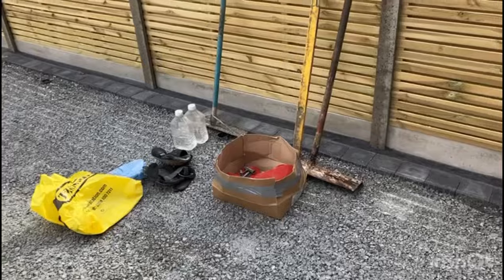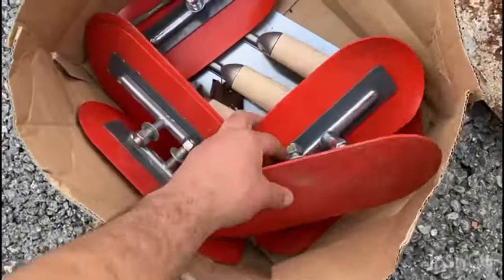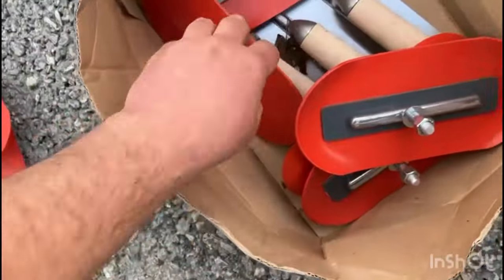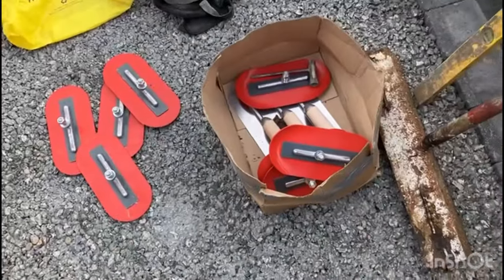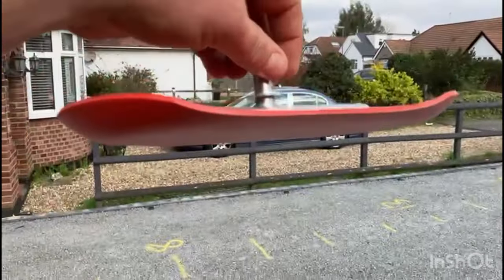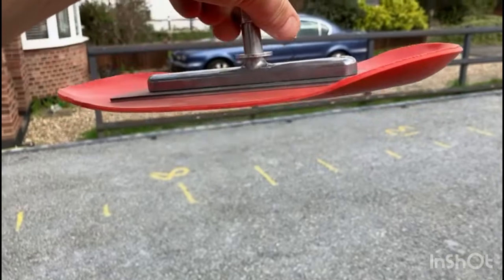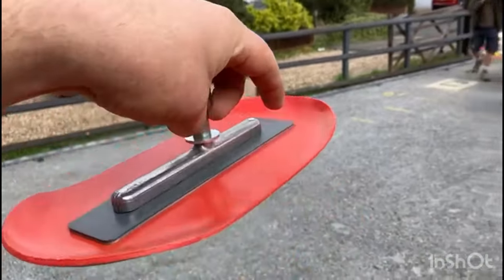You can see here we've got a couple of squeegees to level it out, and we've got a nice little box of tricks. We've got some new power float blades - the plastic ones give you a much better finish than the metal ones. We've got some new hand trowels as well, and there are some new upgraded curved power float blades. I'm not going to try those out on this installation, but I will be trying them out in one of the next videos.